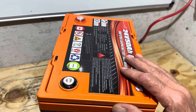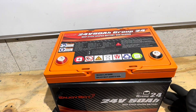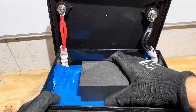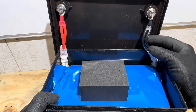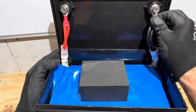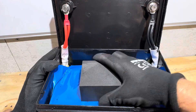Time for the teardown — let's check the heaters, build quality, cells, and BMS. I got the EnjoyBot mostly cracked open. The cells are wrapped in shrink wrap. We've got two number-eight negative wires with 200-degree jacketing and two number-eights on the positive, also 200-degree jacketed, with hydraulic crimp connections and protective sheathing on the wires.